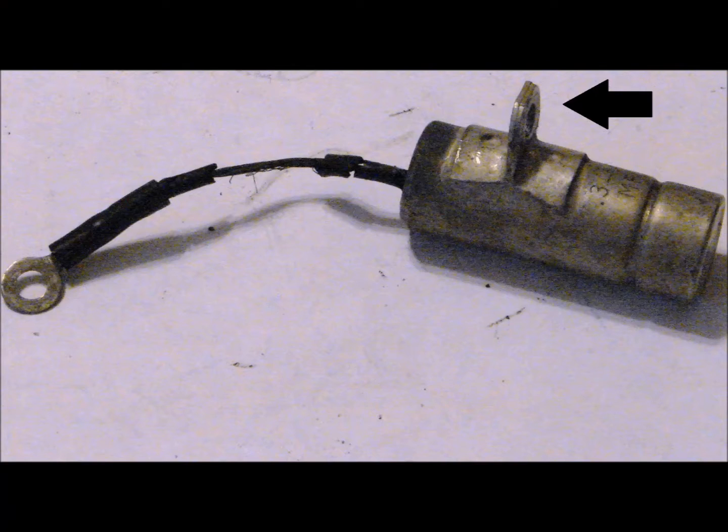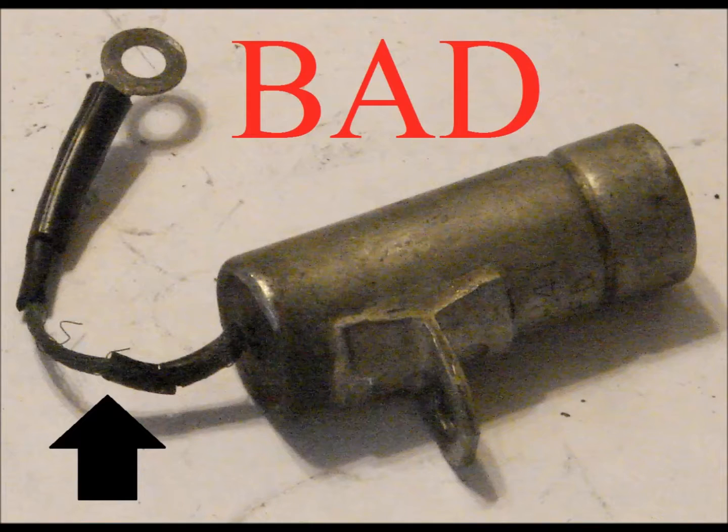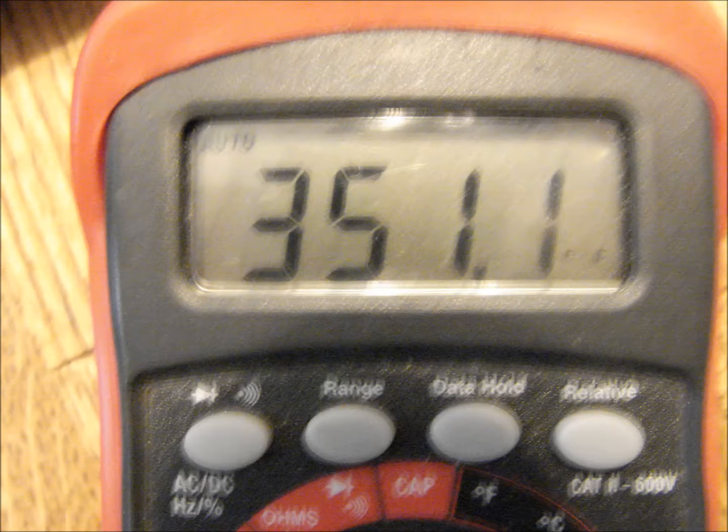The capacitor inspection: visually inspect the capacitor mounting bracket for cracks and security. Check the capacitor lead for damaged insulation or loose terminal connections. If damage is evident or terminals are loose, discard the capacitor. Using a capacitor tester, measure the capacitance and leakage. Capacitance at room temperature should be 0.375 microfarads within a 10% margin of error. The leakage rate at 400 volts DC should be below 0.4 milliamps.